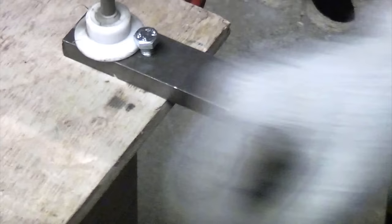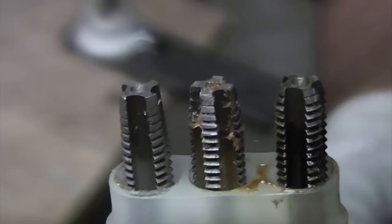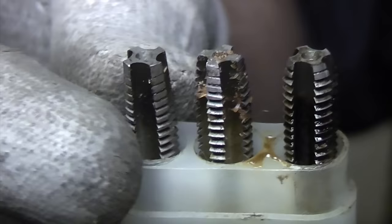You don't always need to use a tap wrench when you're tapping holes. Here we've got a piece of steel that's about 10mm thick and I've drilled a pile of holes in there already, so that hole is now ready to be tapped. Normally what you do is choose a tap with the biggest lead on, which is your starter tap, and you'd normally put that in your tap wrench and then tap a hole through there.